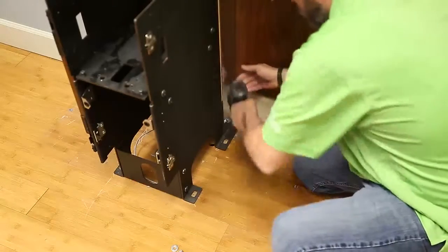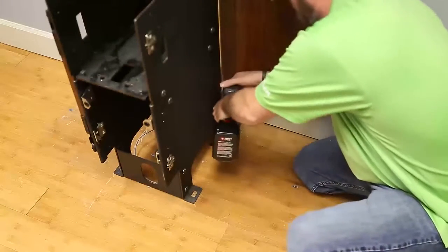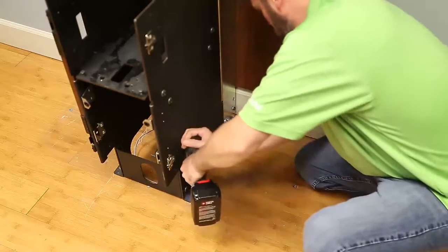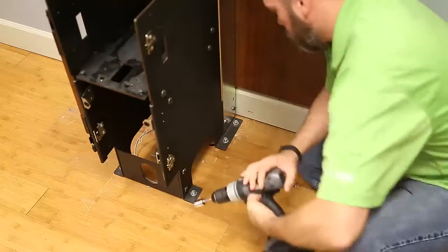Place the cabinet mount section into position and use the front and rear mounting points as a guide to drill the 4 anchoring holes as shown below. Install 4 anchor or lag bolts supplied into flooring.